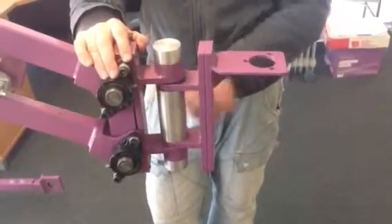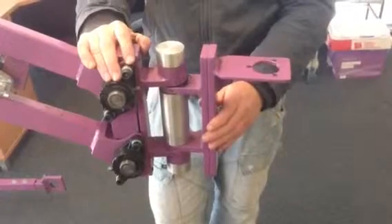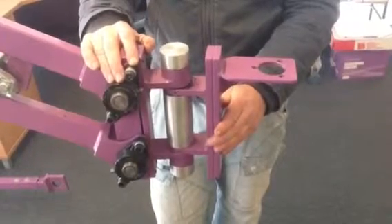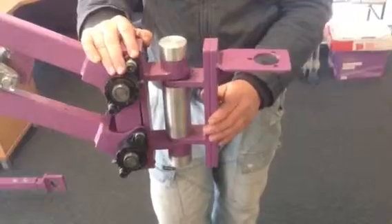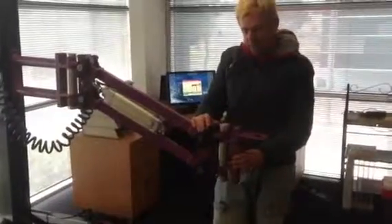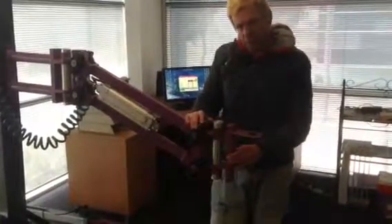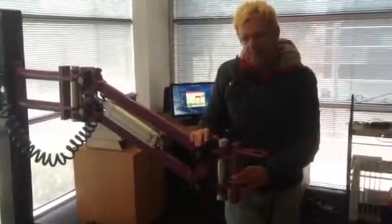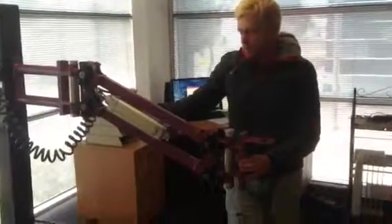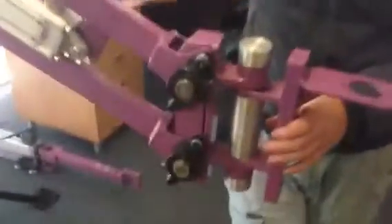When we've come from our stillage to our loading point, we'd then disconnect the pneumatics and allow that to release. We could do a couple of things so that the part couldn't actually release until it was in position — like having some sort of proximity sensor or a PE — so the operator didn't accidentally drop the part prior to it being loaded onto the workpiece. This is a pneumatic arm, which means we can control the up and down motion, and the post would be similar to the Equipoise post.